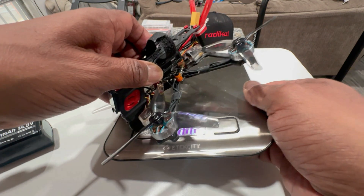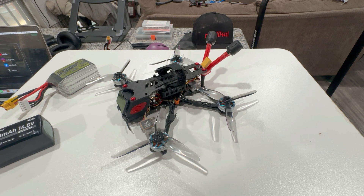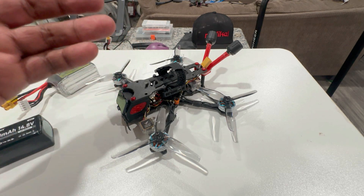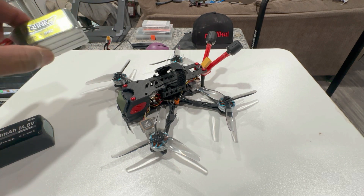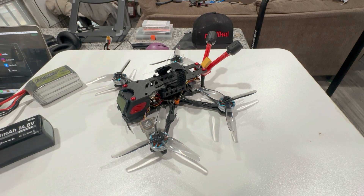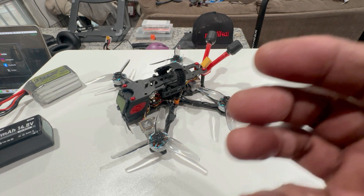I'm also going to give you guys my PIDs because I wanted to show how I PID tune using the PID Toolbox — they do charge now, but I have my own standalone free version from when it was free and I can't just put it on a download link without risking issues with the developer. So what I'll do is another video with all the parts, how we put this together, and my PID tune. You're going to have voltage-specific settings for 4S, 6S, and 3S. That'll be the next video — but right now I just want you to enjoy the flights and how we met some cool people out in the field during testing.